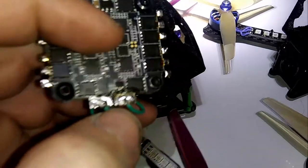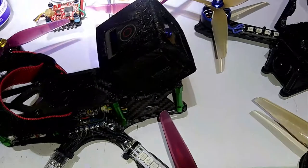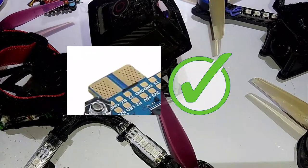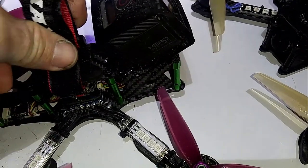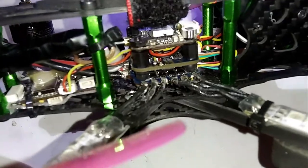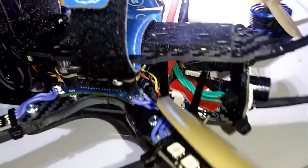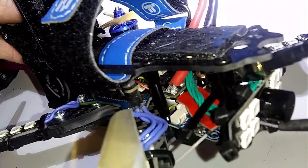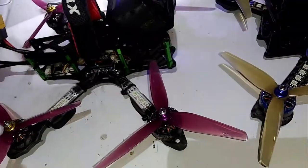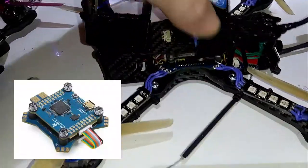I have some preferences now - I have to have actual full pads. Like these little U-shaped pads on the Racer Star, I don't like those at all. I like to have a board with a full pad on it so I can just build a ton of solder on it, and it seems to work a whole lot better. You can see that has a full pad on the end. I like that a whole lot better. I switched over to iFlight - I love iFlight products.